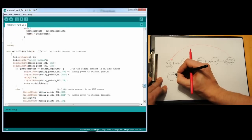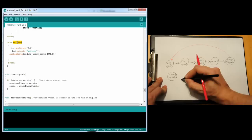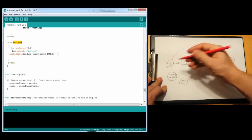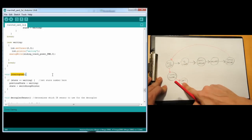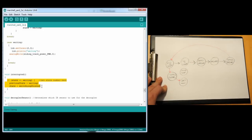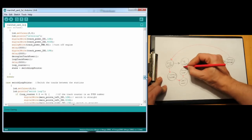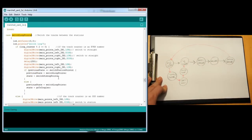When it's detected in the siding it stops. The siding points switch to shut off any power to that track, and the Arduino waits. It's waiting for the green locomotive to trigger its own sensor, which is an interrupt. Every Arduino has a few of these and they allow you to cut into any other part of your sketch and run a little function. In this situation we're just checking that the case is waiting and then we switch the loop points to bring the green locomotive into the station. When that happens we can use these four cases again.